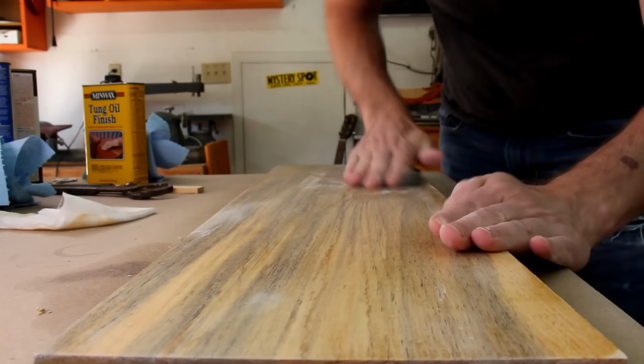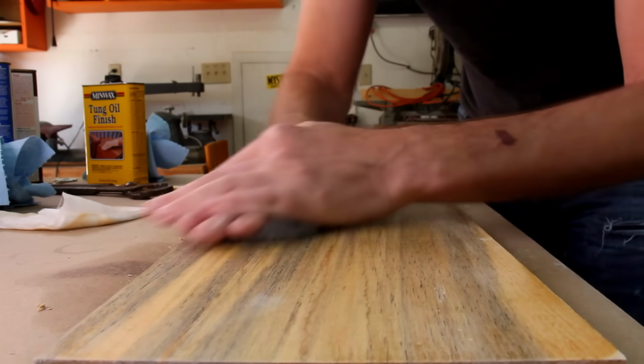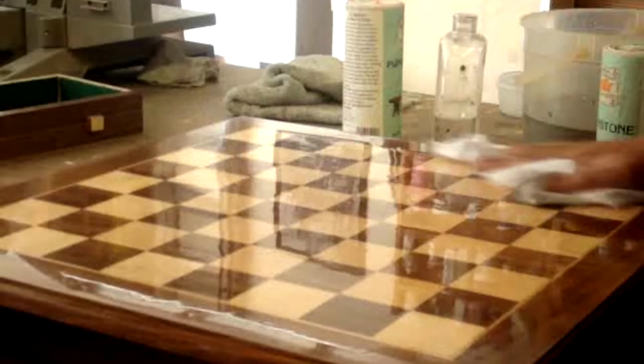One that is very tactile and feels smooth without any dust nibs or other imperfections. I almost always use gloss lacquer. To get an easy satin finish from that, I lightly sand the surface with 4/0 steel wool or a gray synthetic scrubbing pad. If you want, you can actually rub that finish to a super high gloss finish using finer and finer sandpaper and pumice, but that's a topic for another video.